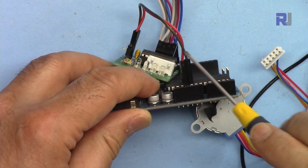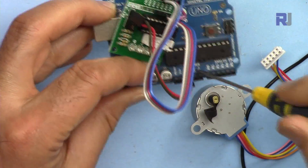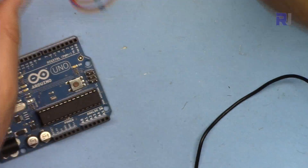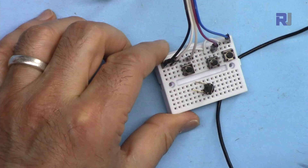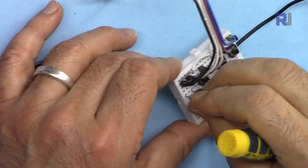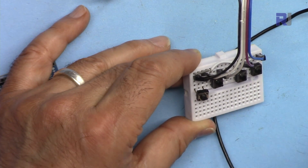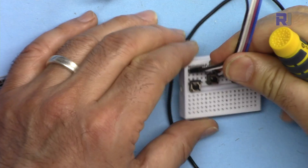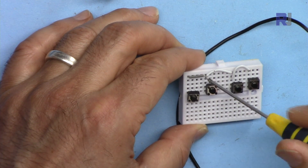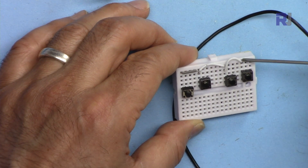The red wire is connected to 5 volts and the brown is connected to ground. For the motor connector you don't need to worry about incorrect insertion. For the push buttons, I have four push buttons here using long-pin type — you can get them from Amazon, eBay, or AliExpress. I've inserted them with one pin gap between them. This is the ground pin, with a wire daisy-chained to provide ground for each subsequent push button.